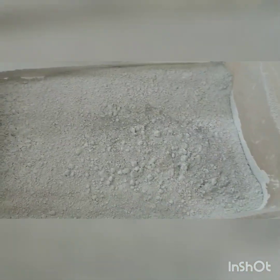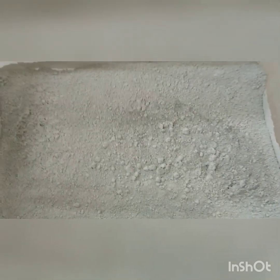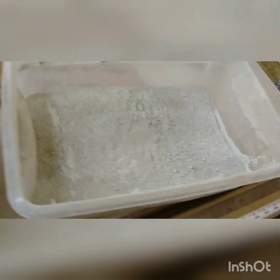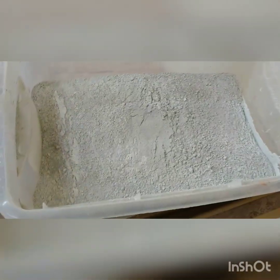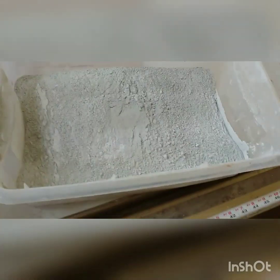This is the color I'm going for — a light gray. Not as dark as the Portland cement, not as light as the gypsum. If I see it becoming too light, I add more Portland cement. If it looks a little dark, I'll start throwing screenfuls away if I think I have enough Portland cement. Now you should have a big container of your sifted Portland cement and plaster of Paris. Next, you need what's called an aggregate.